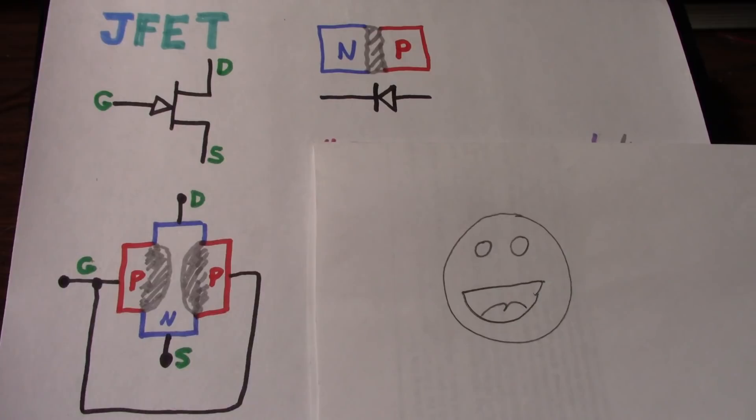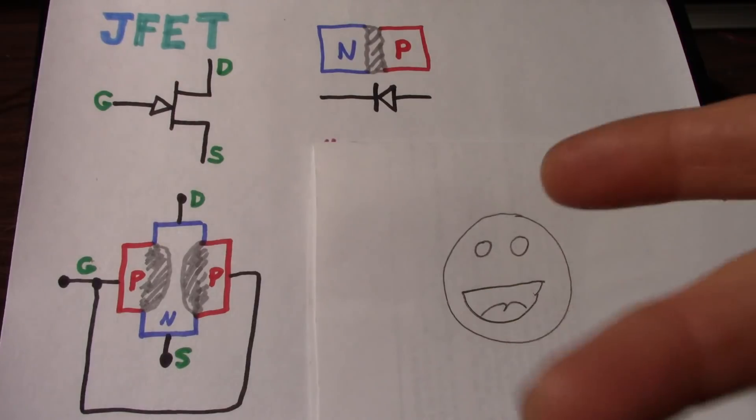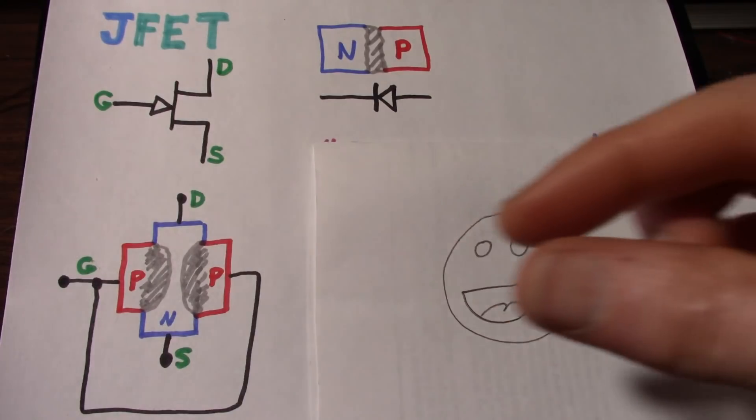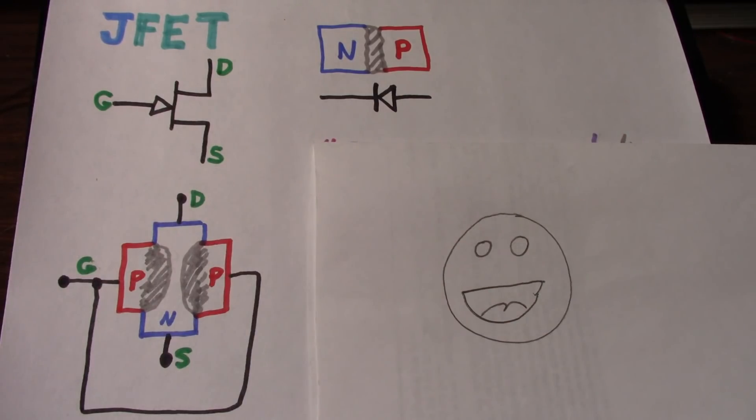Just like any other amplifying device, such as bipolar junction transistors, tubes, or even MOSFETs, you're still going to have capacitance between the grids and plates of tubes, or the junctions of transistors. Because you have changing voltages in an AC circuit across very small distances, you have parasitic capacitances and non-linearities. But in this video, we're looking at what I call the lower frequency, or DC, characteristics of the device.